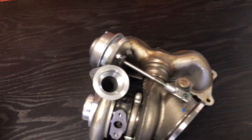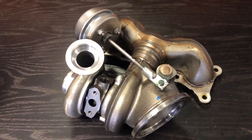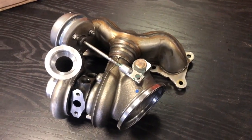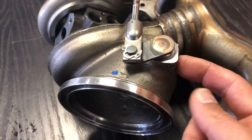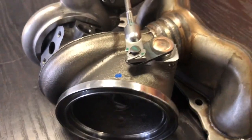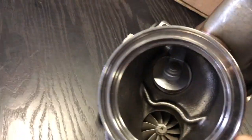It's internally gated, and you'll often find errors where people have had to take vehicles back for a recall related to the original N54 turbochargers and actuator rattle. What basically happens is the bush inside this section of the casting starts to vibrate and undergo plastic deformation — the metallurgical term — generating clearance. The actuator becomes loose and you start losing boost pressure through the swing valve.